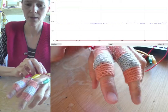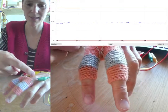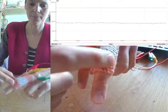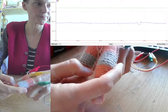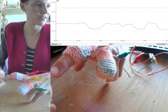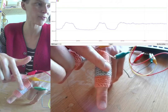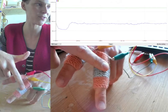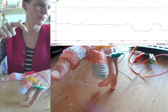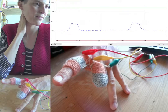The red goes to plus and the green to minus. And between the ground line and the yellow line, there's a resistive sensor that is changing its resistance, becoming more conductive when I stretch the yarn or pressure it or squeeze it, so that the steel fibers in the yarn make better contact and conduct electricity better. You can also do that by pressing on it, but the effect is much more extreme when it's bent and stretched more extremely.